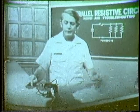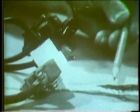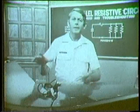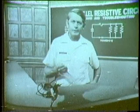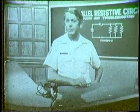Remember also that you can't haphazardly add components in parallel the way we did here. If you do, you could demand more power for the components than the circuit can handle, even though it is fused properly, and you could end up with results like the opening demonstration. Remember, the more components there are, the greater the power dissipated. In our next lesson, we'll look at bridge circuits, a specific use for a parallel resistive circuit.